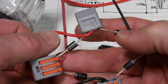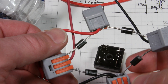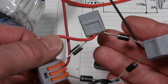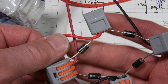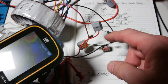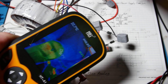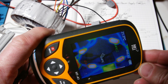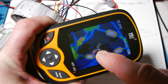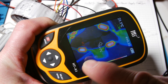Zooming in: you can see the striped sides — the two cathodes of these two diodes go to the plus terminal, and the two anodes go to the minus. The AC connections each have one stripe or one non-stripe. That's how they connect. Now I'm going to turn the lights down a bit, hold the camera over the circuit, and hit the switch so we can watch those diodes heat up.